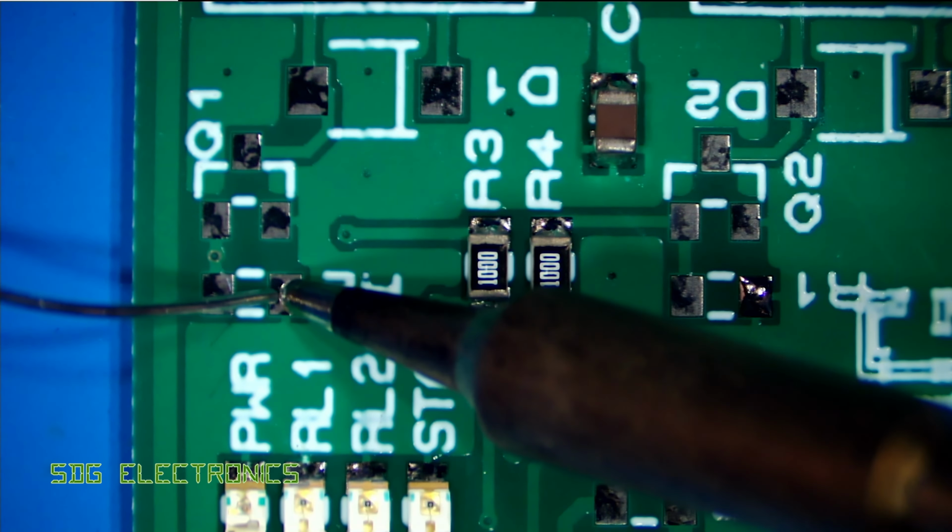we let it settle at 310, and we'll just test it on a different connection on the PCB. And basically nothing happens there. Now if we connect it onto this trace here, we do get something happening. And it does bump up the temperature a little bit, but it seems to realise what's going on and then lock out. So they haven't fixed it entirely, but they have prevented the temperature just going up uncontrollably to maximum